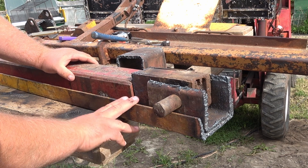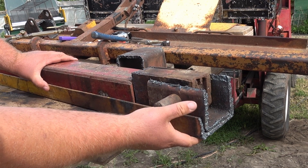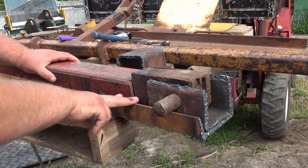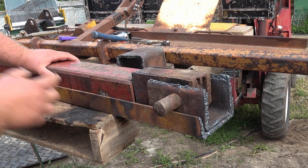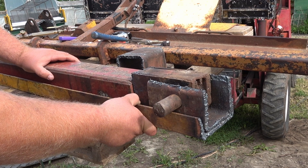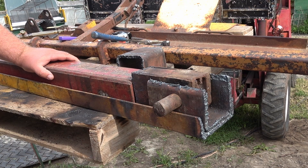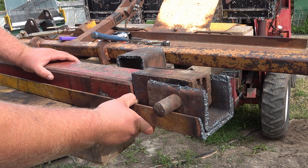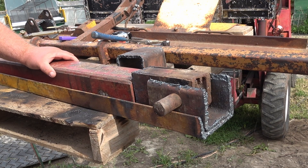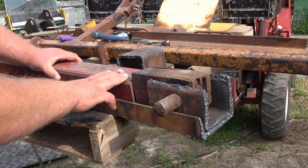This channel iron that is all setting in — this joint is going to be welded down to it. And this stick of channel is going to be welded to the hoe arm itself. On the other end of it, it's going to have the mount for the hydraulic cylinder. I wanted to put this channel on the arm for a little bit more assurance that it's not going to tear the arm up, because this isn't a very big block of metal to be welded onto the stick of the hoe. This channel is real thick and heavy, so it should be plenty to help support the arm. My whole goal for this build is I don't want to do any damage to the machine itself.